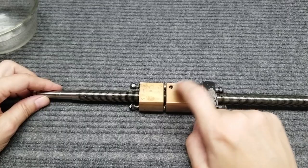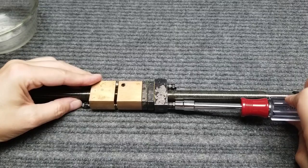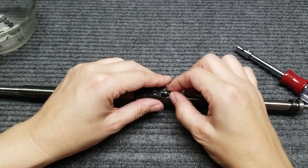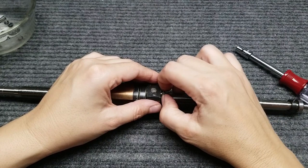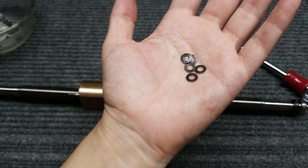These are both threaded blocks. They get preload using this spring system - it's anti-backlash with springs on this side, and there are more Belleville washers preloading these bearings on this side. In here you can see the little hole - I only want to get the wick system going again, because that fed oil onto the shaft. Unfortunately I don't have my little wrenches today. This thing is really fiddly and it gets worse.